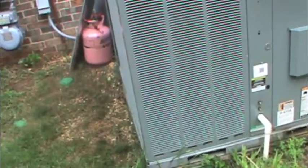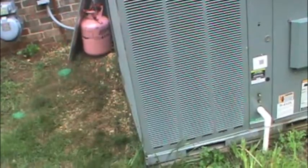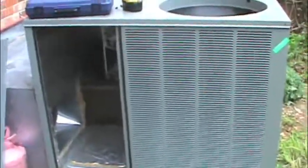This is a warranty unit from 2010, so we're going to get a replacement warranty coil — probably tomorrow. We'll call for availability. Some manufacturers even charge a warranty handling fee, and some don't. If it's an ordered part and not in stock, there's also shipping to consider. This is a 14 SEER gas package, so we're going to button it up and quote them out.